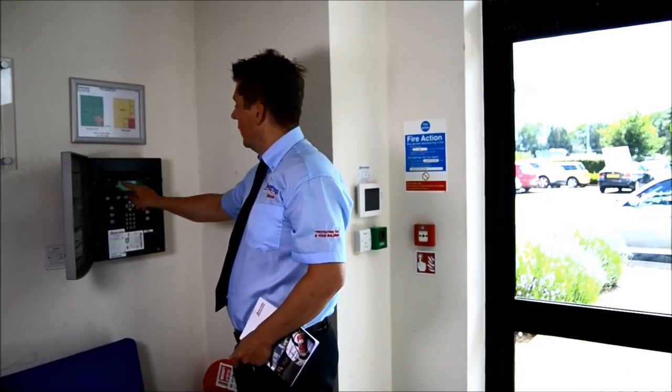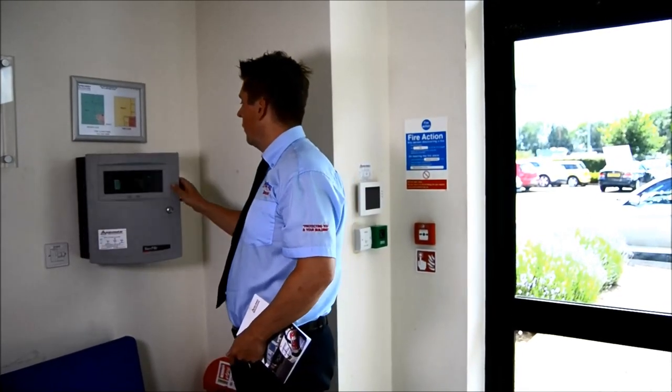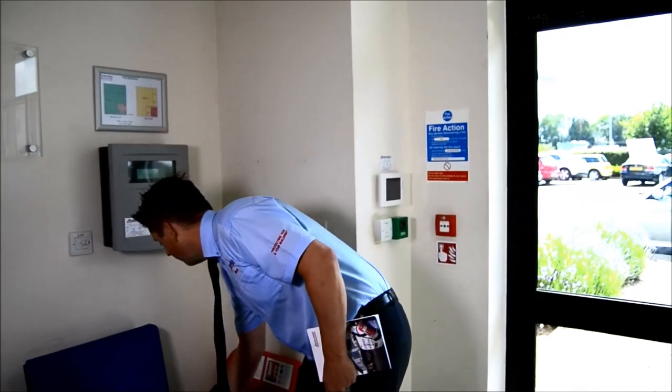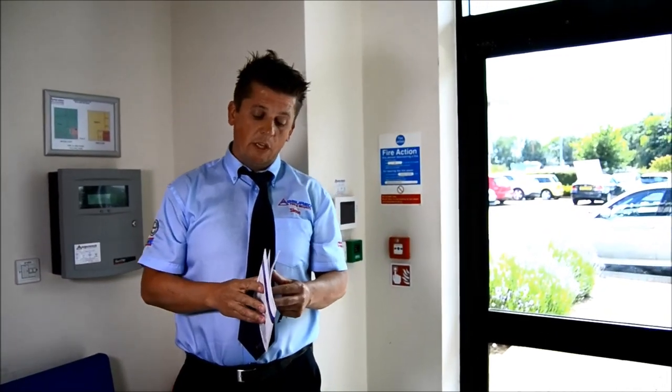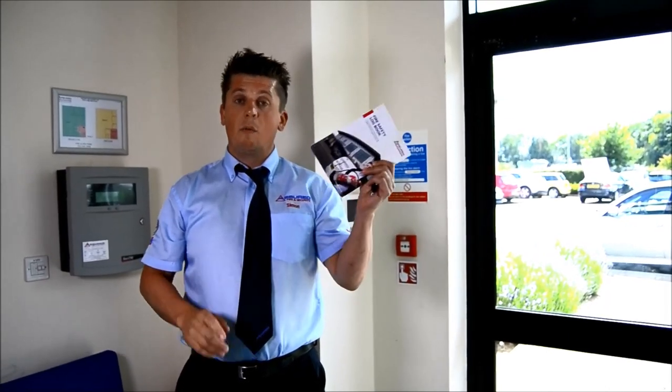Once you're completed, make sure the panel says it's healthy or there's no fault or fire signals. Then walk around the building, making sure everybody's heard the alarm, and then complete your logbook.